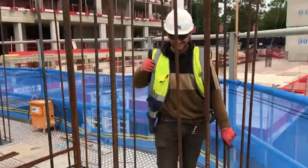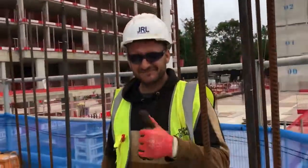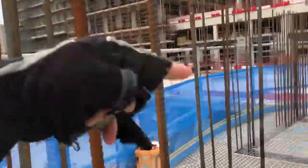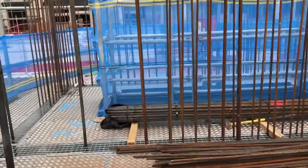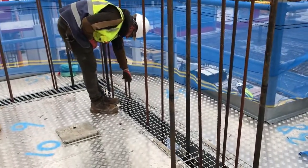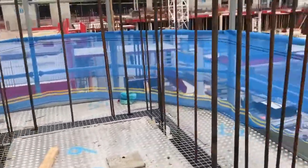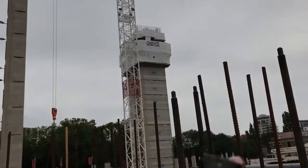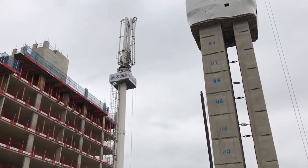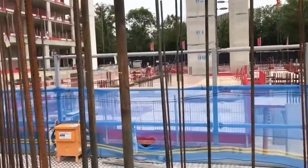I work with this man on other jobs and he's doing the job here as well - a very good crew. That's how it looks: all steel deliveries, everything including concrete, come from this working deck. Steel is delivered here and the guys are sliding the bars down, while the fixer down there is tying and splicing them. That's how the wall is extended. Up there the guys are using a placing boom to put the concrete into the slip form.